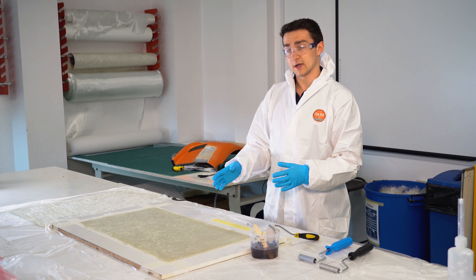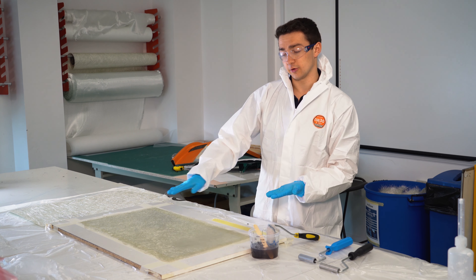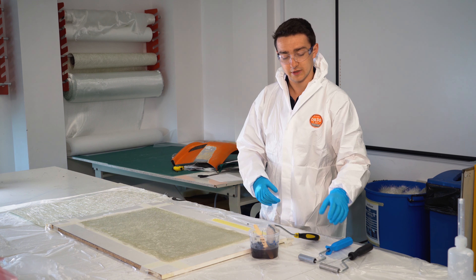Now that we've got one layer on, that's perfect. We know that we have good bonding to gel coat, if it's there, or to the wax that's over that mould. Next, we've got two layers, so we need to do exactly the same again. But this time, when we consolidate, we need to use the paddle roller. So, we've put some more resin on. When it comes to using this roller for the second time, make sure you don't push down too hard — otherwise you're going to move all of that fiberglass that you've worked really hard to squish all of the air out of.